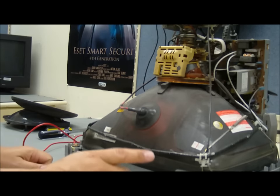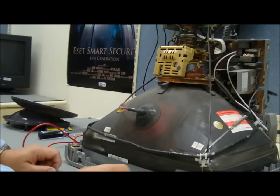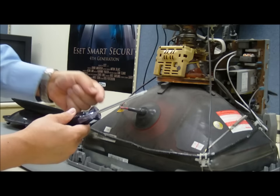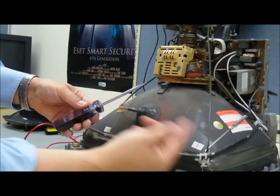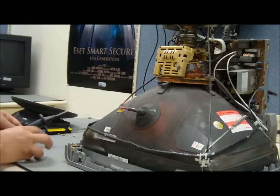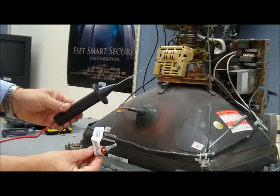What we're trying to do now is to discharge any remaining charge that might be built up inside the tube assembly. What we can do is take a screwdriver, tie off a piece of copper cable on it, and then ground it off that way. But to be a bit more elegant, we'll use a specialized tool which is designed to do this.